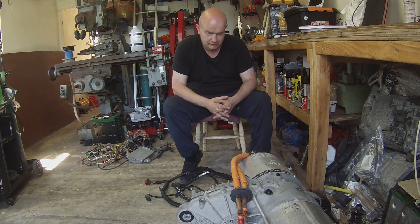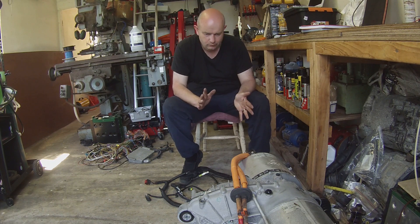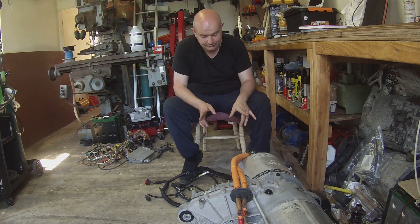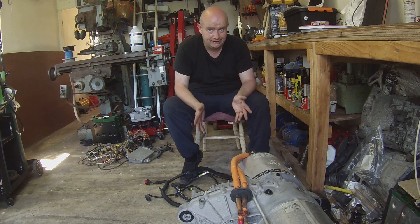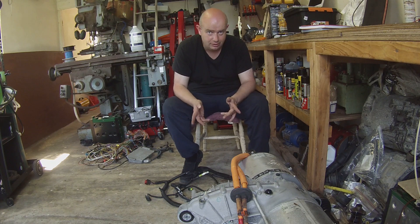My dual-track approach: the first thing I'm going to try — I'd say I've got maybe a 20% chance of making this work — is to run it up with a CAN capture from a friend's car. We're going to get it powered up here by itself, see what CAN IDs it transmits out, eliminate those IDs from a complete powertrain CAN capture, and then play them back to this thing with the necessary analog signals in place and see if it will spin.